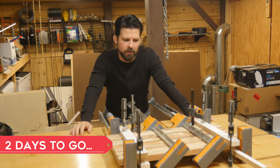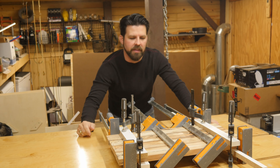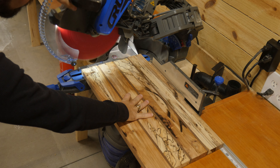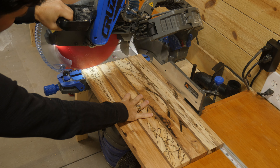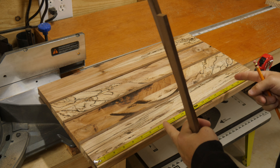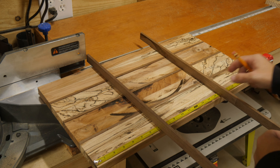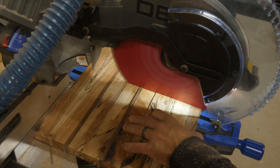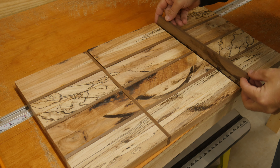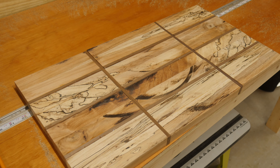It's the next day. These have been in the clamps for about 16 hours or so. I'm going to go ahead and take them out of the clamps and trim the ends up. Then I'm going to insert two vertical strips of walnut into this. I'm coming in from the outside edges to a symmetrical distance — about seven inches — and making a cut all the way across; that's where the walnut strips are going to be inserted. Now I'm going to glue that up and let it dry till tomorrow and then we'll finish it.